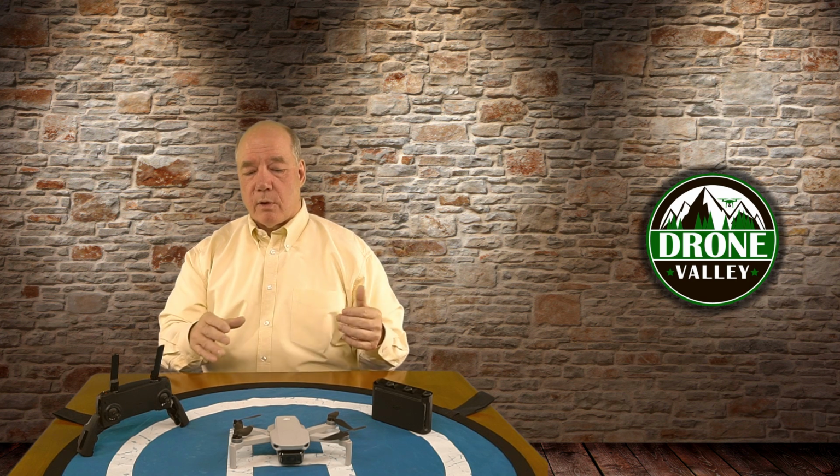And the first thing you'll notice when a transmitter is going to have issues is you won't lose control of the drone, typically. What you'll do is you'll lose the video feed. It'll start getting choppy and maybe you'll get some errors like loss of control. The first thing I notice, and I know I'm going to be in trouble, is when I get choppy video sent back, because the first thing it's going to lose is the video. So if you start to see choppy video, pretty good chance the controller got cold on you. Take it, put it inside your vest, let it warm up a little bit before you change the battery and fly again. And that's pretty much all I had today.